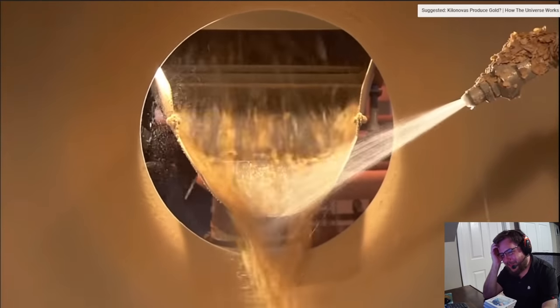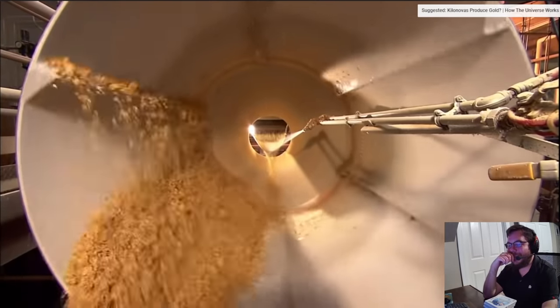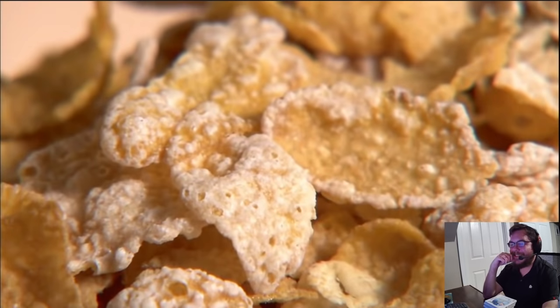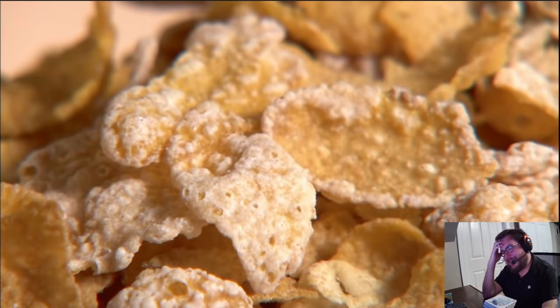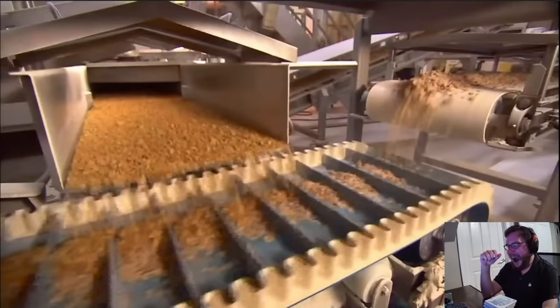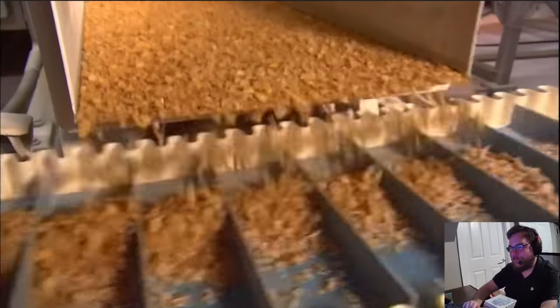The other stream of wheat and cornflakes enters the sugar coating drum. A sprayer disperses a sugar and water mixture as the drum tosses the flakes. Then they travel through a dryer, and this cools the frosting to the flakes. The frosted and the flavored flakes now flow onto the same conveyor. It bounces the flakes around to blend them together.